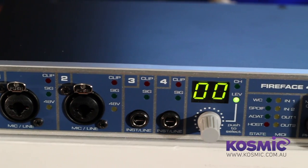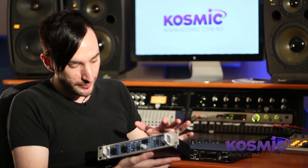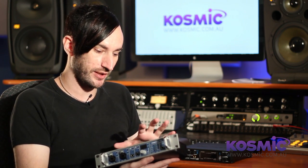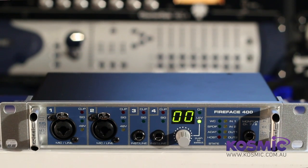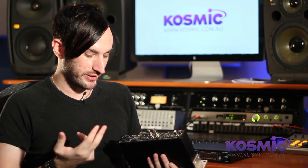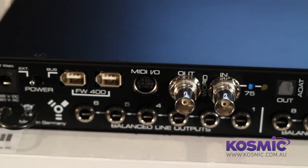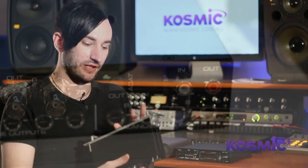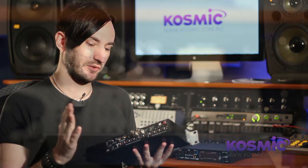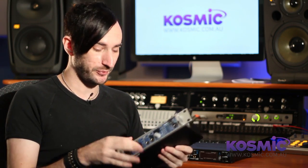Next let's take a look at RME — a really nice company that makes some very nice products. This is the Fireface 400. To look at it you don't see a lot going on, but the converters in these things are exceptional — you'll get a really nice open sound with crisp highs and great frequencies across the board. On the back there are two Firewire ports so you can daisy chain or connect another Firewire device without losing your computer's Firewire connection. There are balanced outputs and inputs, and optical in/out as well, so if two mic preamps aren't enough you can add an external microphone preamp. This interface also has particularly good mixing software for routing ins and outs internally.